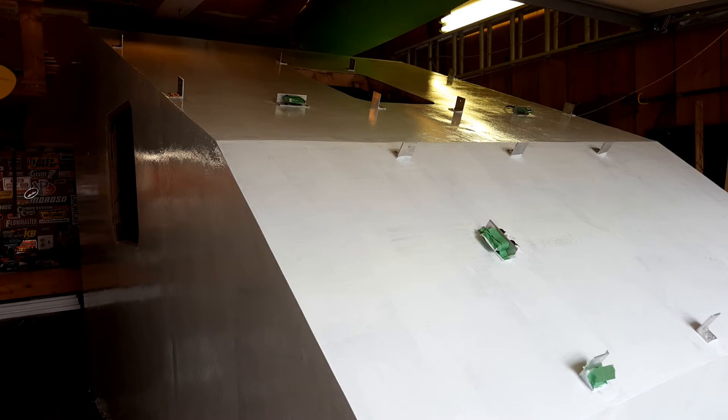Another thing with this stuff is that I think you have a maximum of 18 hours after painting to put a second coat on without having to sand. So once this one's dried up, I'm going to put on a second coat and maybe a third coat if it needs it, but that might actually be late tonight, like midnight, so we'll see if I record that.